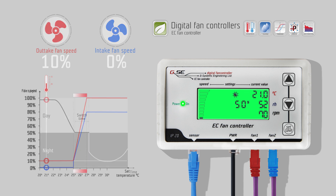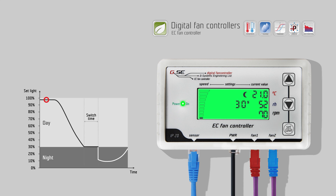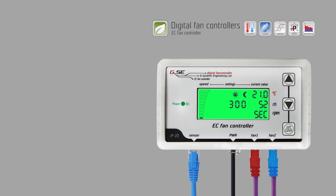Press down to go to the light sensor switch setting. You can see the alternate blinking of the sun and moon segments. Press set/save to change the switch level value between day and night time — the controller will switch settings when the light is below 30%. Press down to go to the light sensor delay setting. This countdown is used to avoid an immediate switching between day and night mode when the light sensor has reached the switching level. For example, we set the value to 300 seconds. When the countdown ends, assuming it doesn't get interrupted by light at the light sensor, the controller will switch from day to night time. In reverse, the controller will switch from night to day the same way.